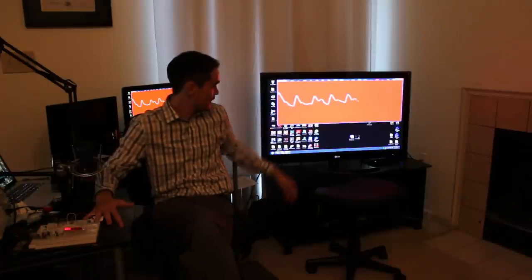To test it out, I lay my finger across the LED and detector. Down here I have some LEDs that correspond to my heart rate, and that information is also transmitted to the PC where we're running a Processing sketch, which goes down the HDMI cable to the TV. It's a cool project involving detection, amplification, filtering, the Arduino part, and the Processing sketch.